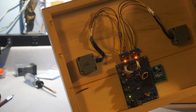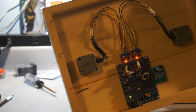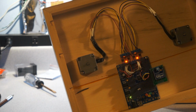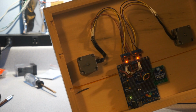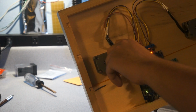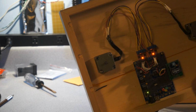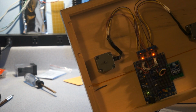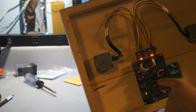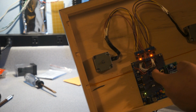if both your inputs are high, both of the outputs are low. So you have to kind of fidget around a little bit with how you're driving it to make it work properly. I've actually wound up splitting some of the phases around here just to make the stepper motors work properly, because one of the things I'm doing here is micro-stepping the system. Again, because I've got a lot of processing power here.